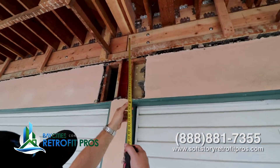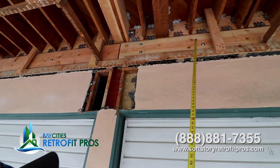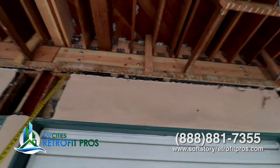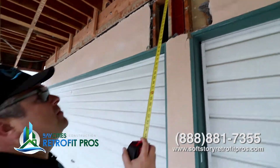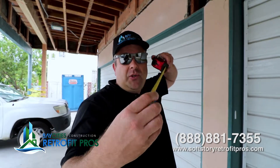What we did is put four-by lumber on both sides of the beam and attached it with through bolts in a staggered pattern, running the entire length of the building wherever we have the steel. We also reattached from underneath with bolts. There's a bit of wood above the section and some through bolts as well. This is going to prevent torsion. When we're dealing with seismic force, everything wants to twist — that motion is really bad for the building, so you have to fight it wherever you can.